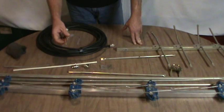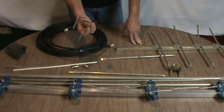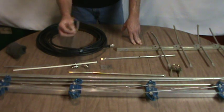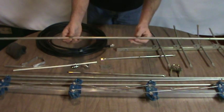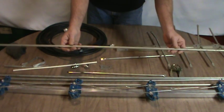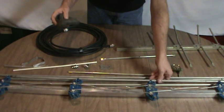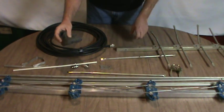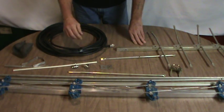From the last TV antenna we also have this aluminum strap — we're going to need that to help make our gamma match. I'm going to flatten it out and make it into a connecting bracket for the gamma rod. These elements really need cleaned up — they're kind of gray on one side, some of the gold coating is still on the other side — but I have some steel wool and I'm going to use it to clean up the elements. They'll be bright and shiny by the time we're finished.